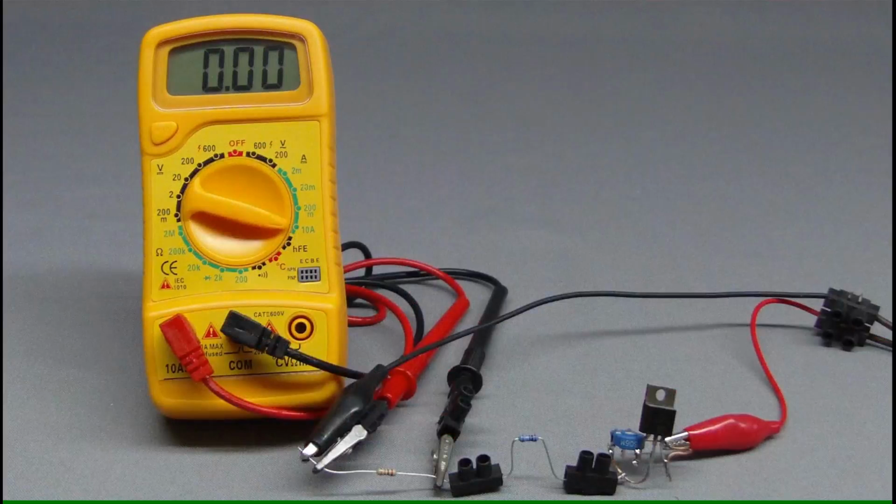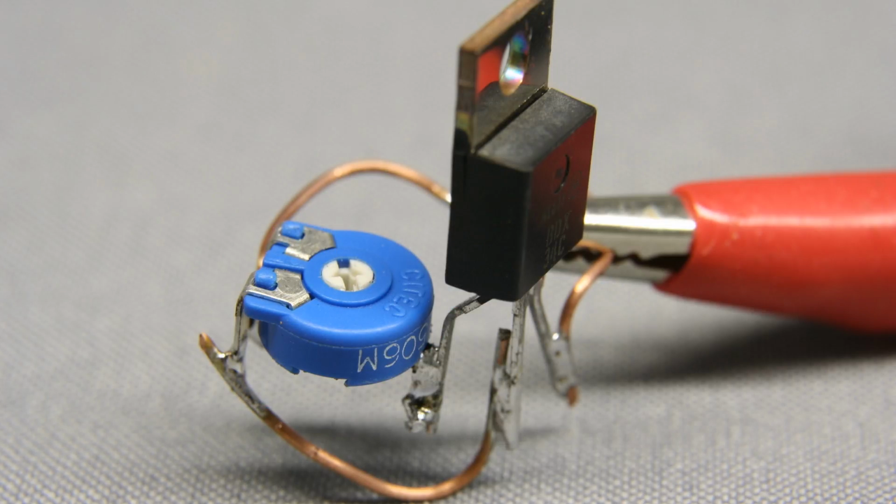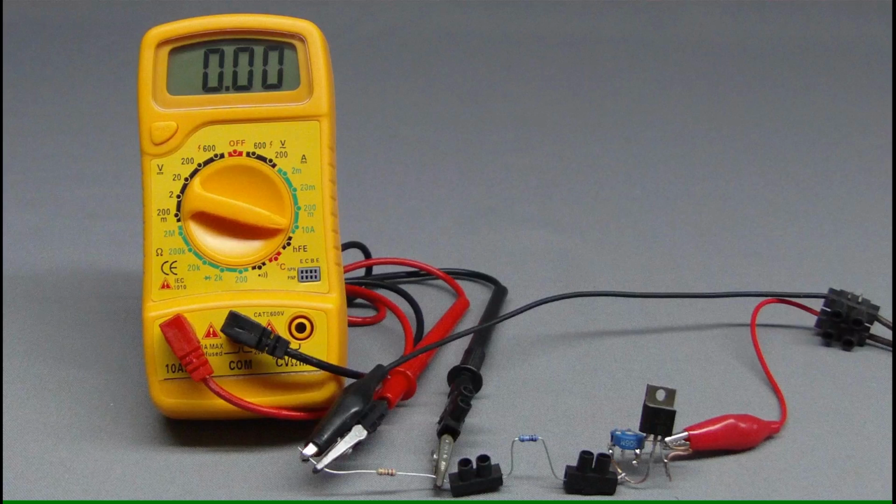The resistor is connected to an adjustable DC voltage source with a maximal output of approximately 10V, which is non-hazardous for human life. The very simple control electronic consists of a single PNP transistor with a potentiometer connected to the base pin. Another video will show how to build better adjustable voltage sources.